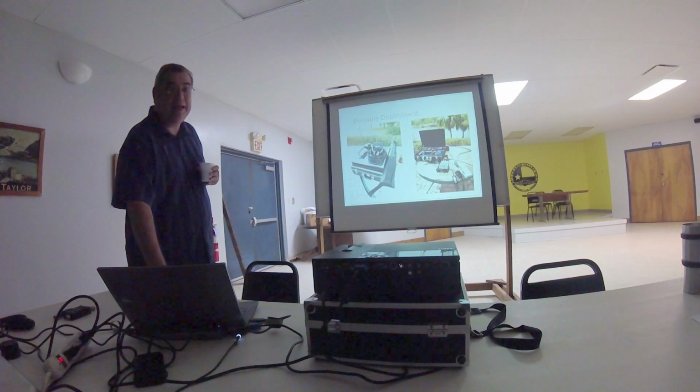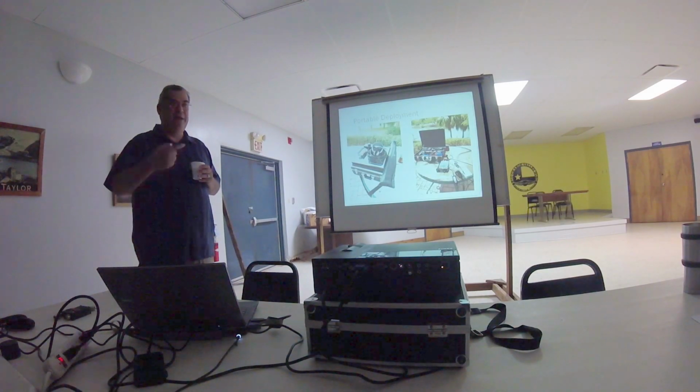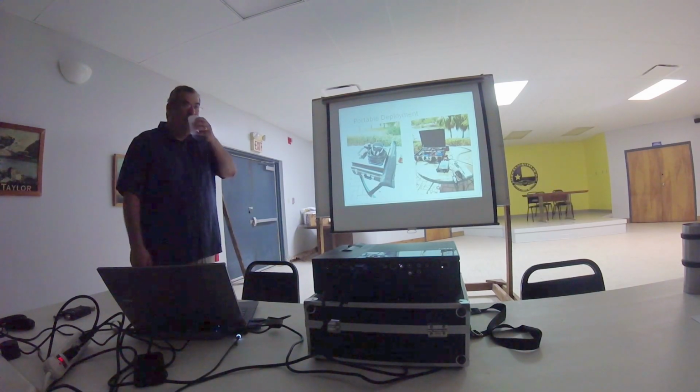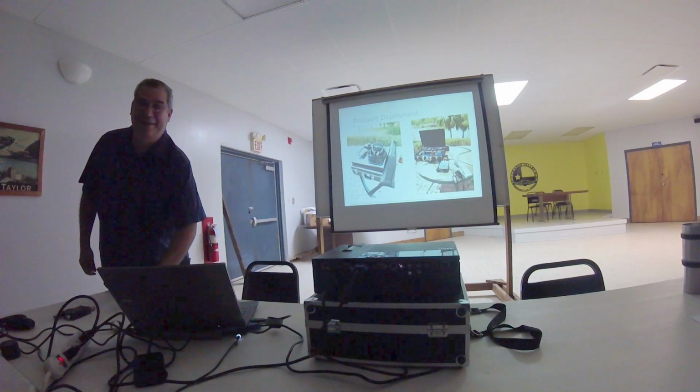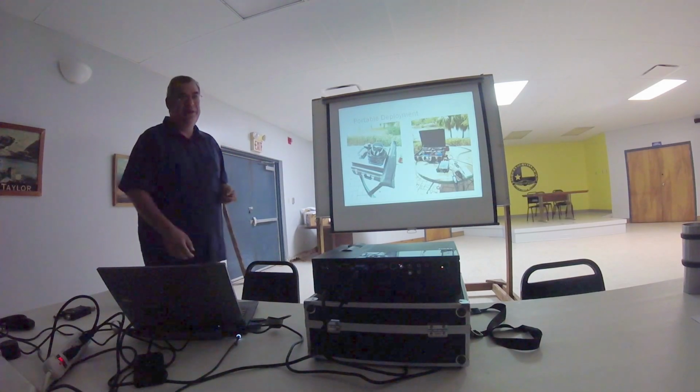So let me back up a point. I'm sorry? Common mode choke, don't scatter wind. No. It should be linear wound. Yeah. Well, that's one way to, definitely. Because if not, the first coil might touch the last coil and do you no good at all. Well, that's true. I mean, you've got to take some care in the way you wind it linear.